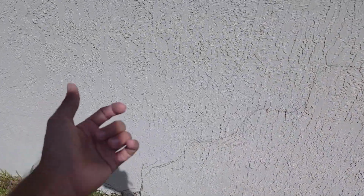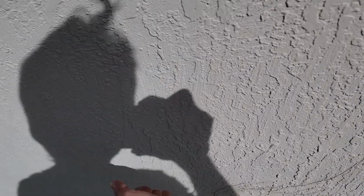Now if we punch this way, this is stucco, and if anybody's familiar with stucco, when you drill something coming out of the stucco, that's just going to flake. This line that you're seeing here are the bricks, so I can actually see where the bricks are laid, but stucco is very flaky. So what I really want to do is drill from the outside in. So I need to identify where I really need to put the position, and then out here is where it's going to be the dry cooler.